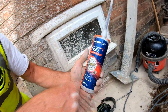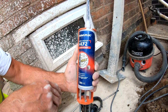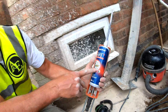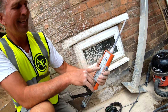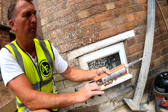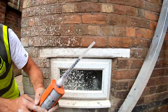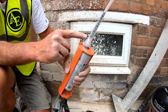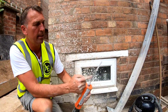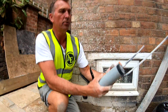The chemical resin we're using is called Raw Plug RKF2 — it's a polyester resin. You can pick this up from any local merchant; we actually get it from Jewsons. Once you've cut the end off, you have to pump the gun through until all the chemicals come out the other end fully mixed. The chemical comes in two colors — a very light cream and a dark gray — so you can see when they're mixed together.